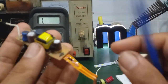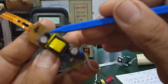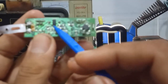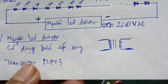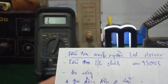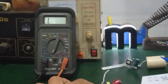I'll measure to show you. This is the output filter capacitor. This is the 13003 transistor. There are also some SMD resistors for biasing and a diode here. The components are quite simple. In this circuit, the key difference is the use of a flyback transformer and the 13003 transistor. The most common failure point is the 13003 transistor.